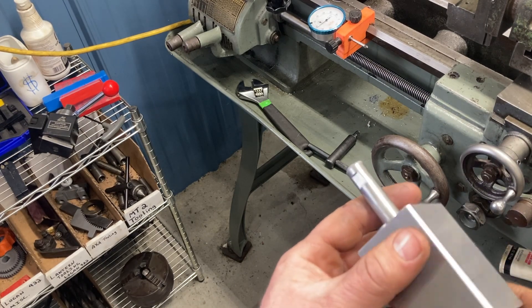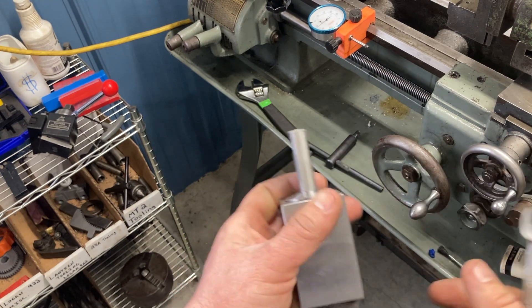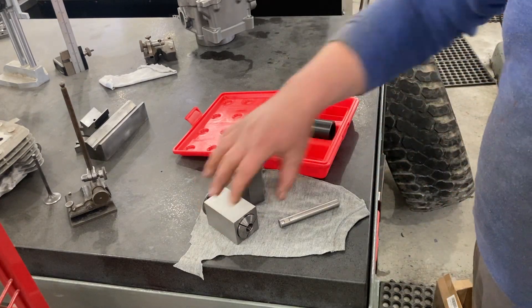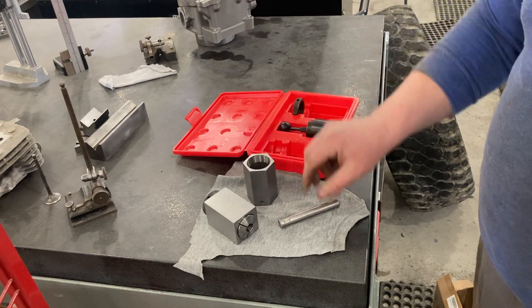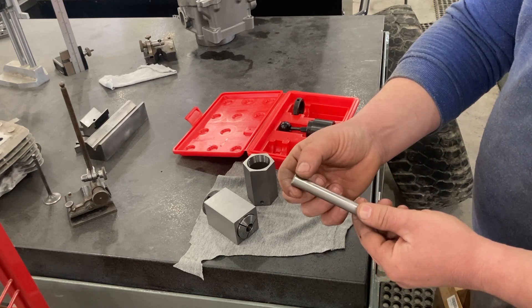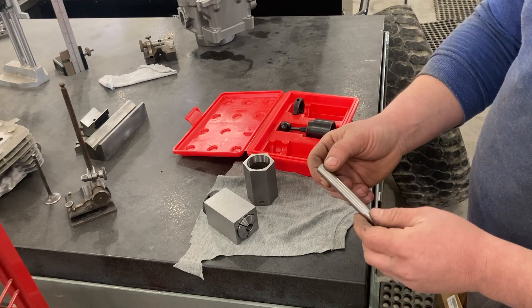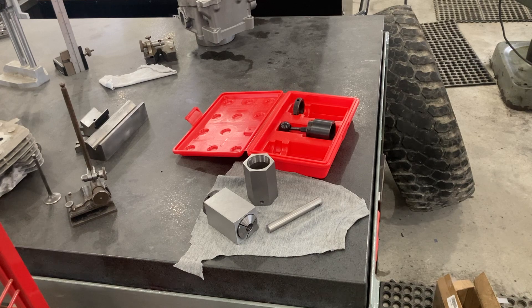Here's the finished product — we have our flats. Our 7/16 wrench goes on and gives us a little bit of clearance to the wrench. I'm happy with this and you can see how the collet blocks work. I hope you enjoyed seeing how a collet block can be used on a lathe to mill features. The same exact process with the hex block just takes a little bit more time. If you wanted to make a custom bolt, you would turn this diameter down, leave the larger section big enough for whatever hex shape you want to make, and you can kind of put that together in your own mind. Thanks for watching — let me know in the comments if there's anything else you'd like to see, especially in old-fashioned machine shop work like this. This is Jeremy at Hiltz Machine Works.